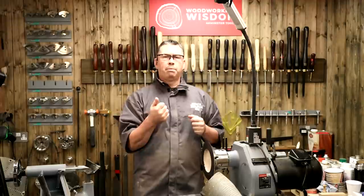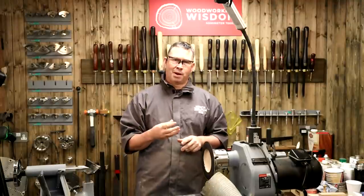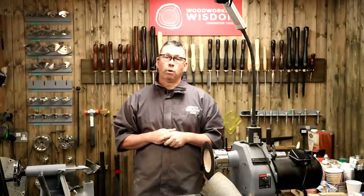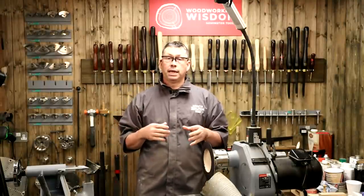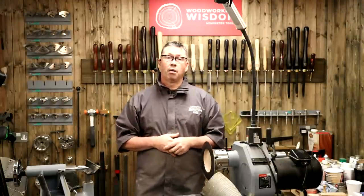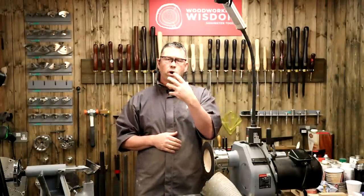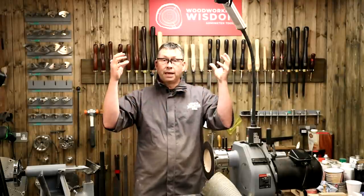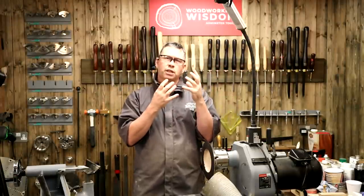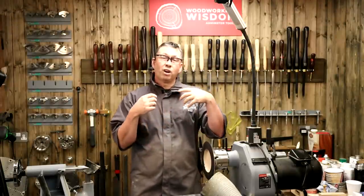There is a difference. If you use a paper mask, and certainly at the moment a lot of us are wearing paper masks, dust masks are okay for a limited amount of uses, a limited amount of jobs. As an everyday go-to mask, brilliant, but you will have to dispose of them after every use or every couple of uses. The thing with your respirator is not only is it protecting me from dust, pumping clean air after it's been filtered through the two filters, but it also protects me from things flying from the lathe. So chips of shavings going in my eyes, or anything worse than that.